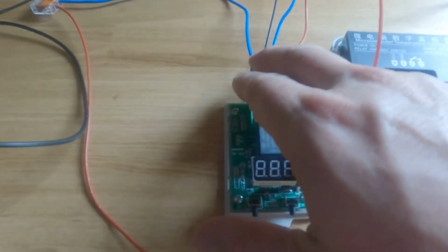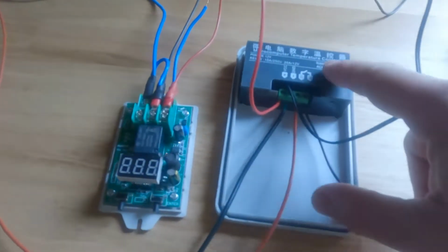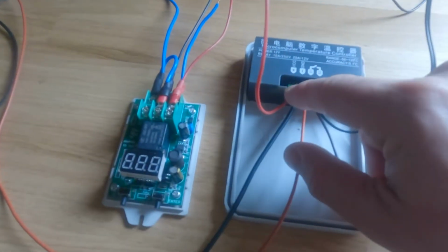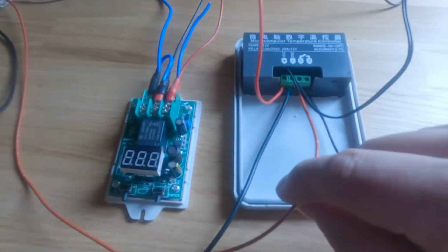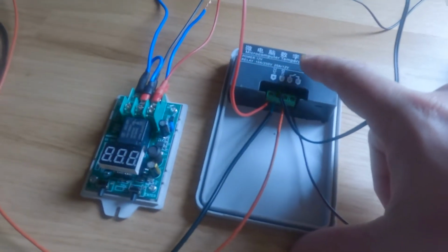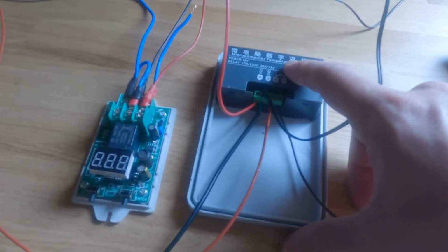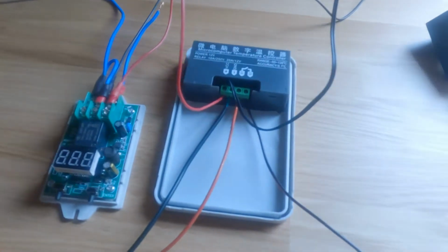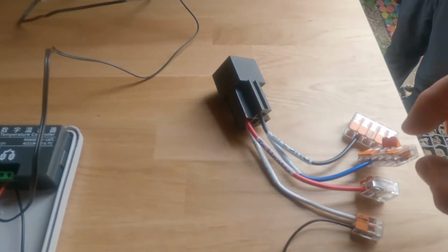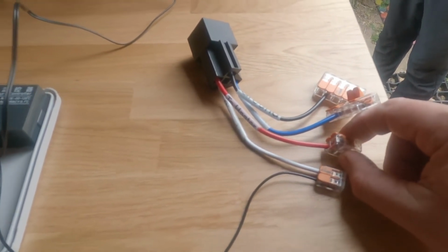It will take the power down here, through here, pass through the switch over into the temperature sensitive relay, which comes in on this line here. This here is its feed for the outline. The temperature is set to cut off at about 35 degrees, so all the time the temperature is below 35 degrees it will pass power on to the last relay, the load relay, and then from here this will supply power to the 300 watt 12 volt heater element.